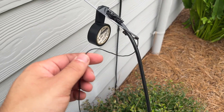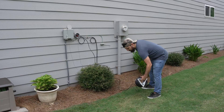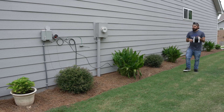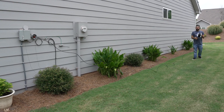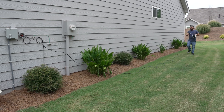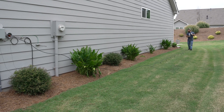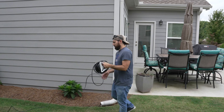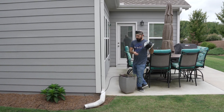I did run a string along with the Ethernet cable that I just pulled through. The Ethernet cable we ran into the house is an outdoor direct burial and UV-protected cable. I am running it along the outside of the house to where the future PoE camera will be installed. The reason it is going along the outside is because there is no physical access to the back of the home between the two floors for a cable to be run.